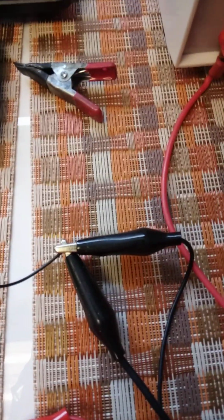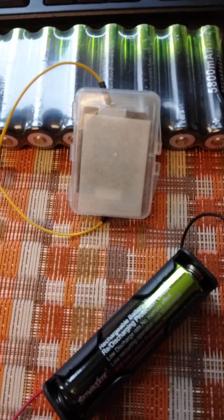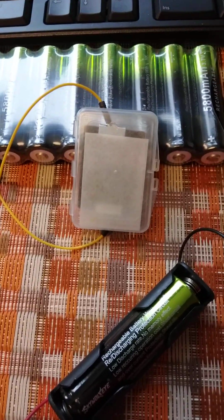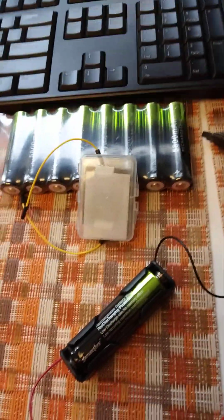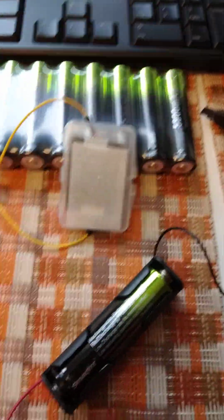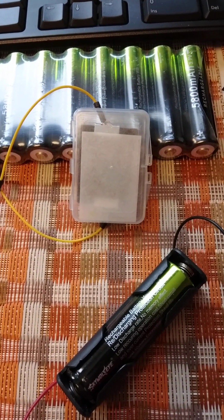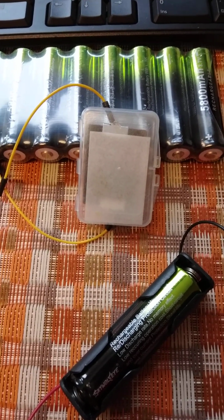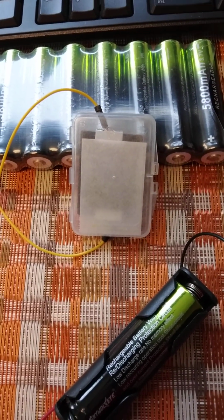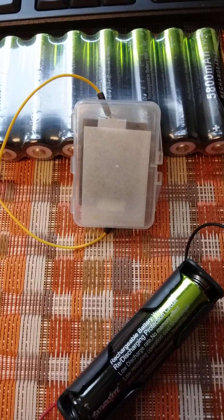And we insert that right into the circuit, and we're demonstrating that we can bring these up to 4.1 volts. Now, of course, 100 cycles is one thing, 1,000,000 is another. But it's a way to look for any flaws right from the get-go and use small amounts. Some of these deep-eutectic solvents and ionic liquids are conductive, but they're expensive as hell. So this is a way to test out a DES or ionic liquid solution with electrolyte.